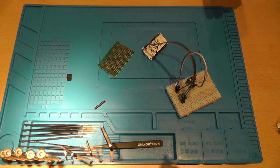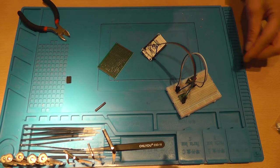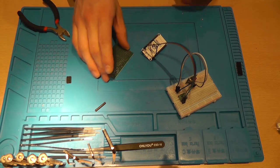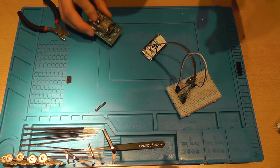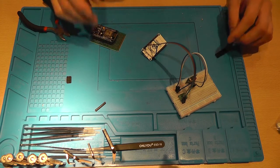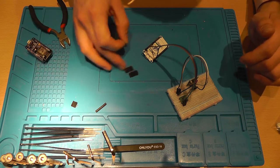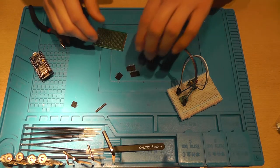Cut it into. Oh, I forgot one thing. You'll also need a 3.3 to 5 volts level shifter. That's needed to convert the various voltage levels. And I'm using a Pololu level shifter. Of course, you need female headers: two 5-pin and one 3-pin, and of course, two rows for the ESP8266.